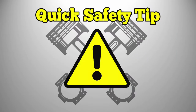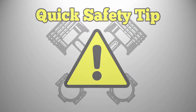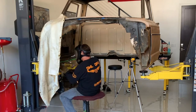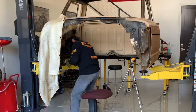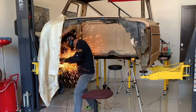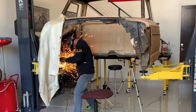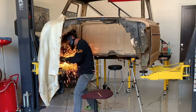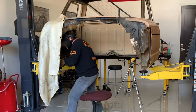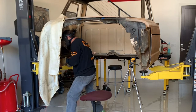You can see most of the teardown of this truck in episode one. I wanted to briefly talk about safety considerations when using a high-speed disc — those things come apart and they'll hurt you bad. So I have double eye protection, ear protection, I'm wearing a respirator, and I've covered my arms, hands, legs, and feet to ensure that if that thing comes apart, it doesn't penetrate any skin.